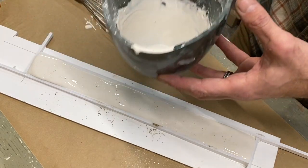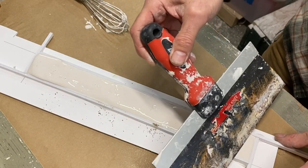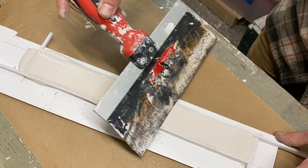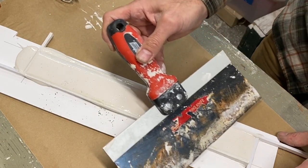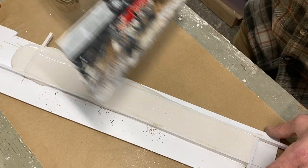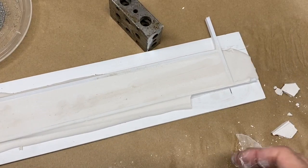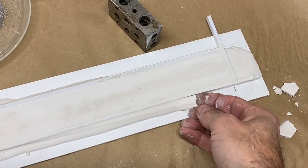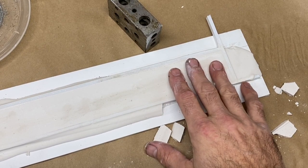Looks like we made just enough. You can see it's heaving over the sides — take a spackle knife or taping knife and skim the top flat. We like to do this at 45 degrees; it seems to work better. I'm going to let that dry for a bit. One good way to check if it's ready is to grab a piece of the excess on the outside of the mold — if it just comes apart like that, the wall will crumble the same way when you take the sides off. So it's clearly not set yet; we're going to give it some more time.